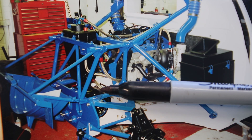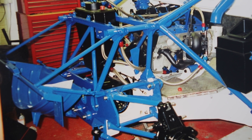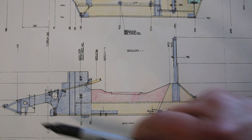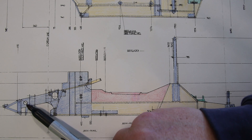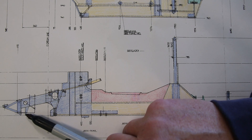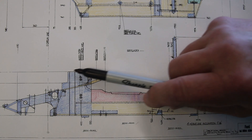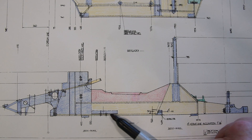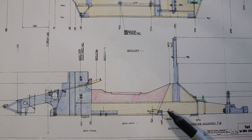There's the air cleaner and coolers at the top, above the bulkhead. Behind the window there's the dry sump tank, the rear diff lives here, and there's provision for carrying a full-size spare wheel — actually at either end of the car so you could carry two spare wheels, or use one as ballast. In side elevation: the frame holds the radiator, oil cooler, and front bodywork. That hole allows a water hose to pass through because the chassis rails are narrower than the radiator. This bracket is for the front anti-roll bar, that hole allows the steering rack to pass through, and this is the A pillar with the door hinge bolt points.